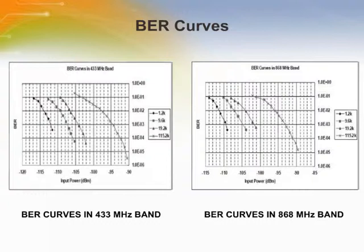This page shows the bit error rate of the device at 433 MHz and 868 MHz. The MRF49XA has low phase noise and provides an excellent adjacent channel interference, bit error rate, BER, and larger communication coverage along with higher output power.